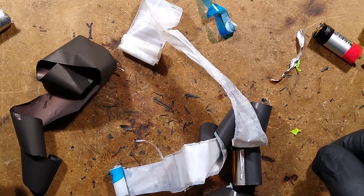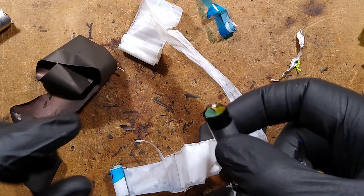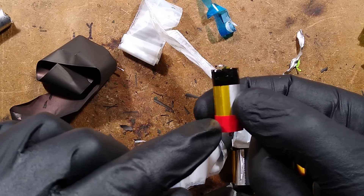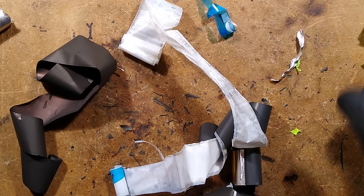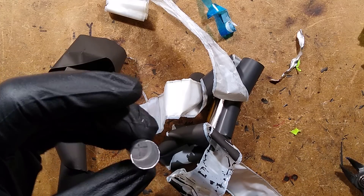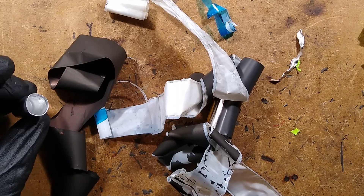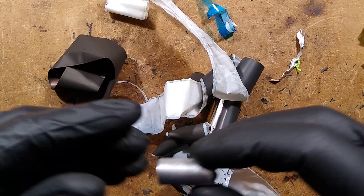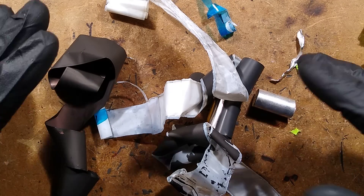It's very classic construction for these — pretty much what you'd find in any similar cell, but this one is just in a foil pouch, rolled up tightly, with a bit of tape on it. So nothing really much more to say — that is what's inside these cells. I do have to say that this one was supposed to be 360 milliamp-hours, but I did not get that capacity; I measured more like 280 milliamp-hours, if that.